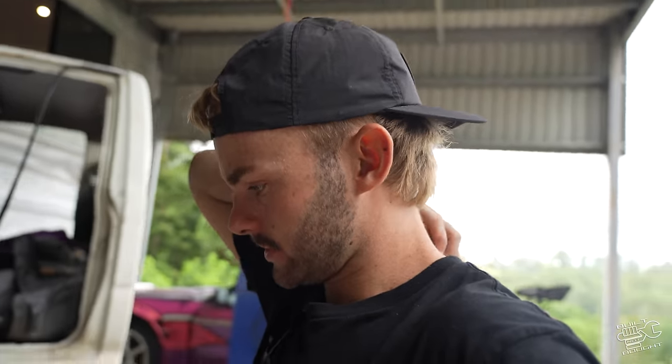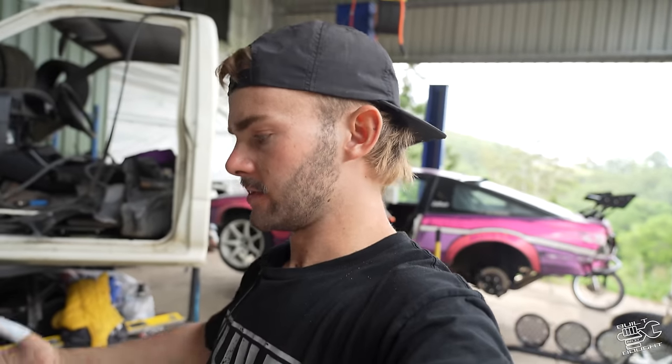So I was painting this bar with acrylic primer and acrylic paint. It's now reacted, and I'm not sure why. If you look closer, you can see a bunch of cracks. I thought I did every little step right, but I think what I did wrong was I rushed it too much, and the paint ended up reacting with the primer because it wasn't fully dry.